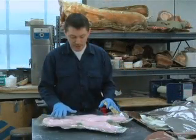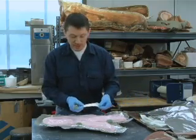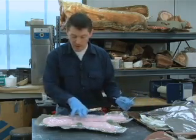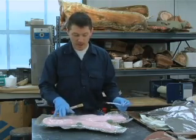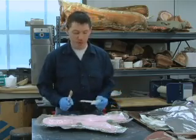I finished the application of silicone to the fossil, and so now I'm going to saturate strips of glass cloth with plastic resin to create fiberglass — a hard shell to support the silicone — and that's going to allow us to make perfect replicas of the fossil without any distortion.